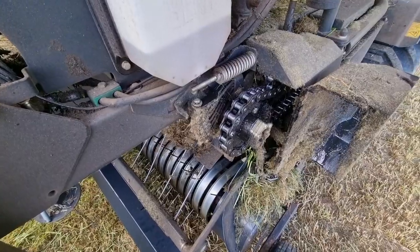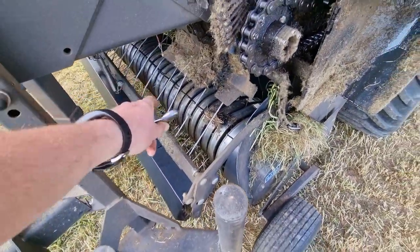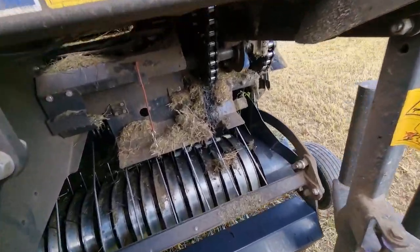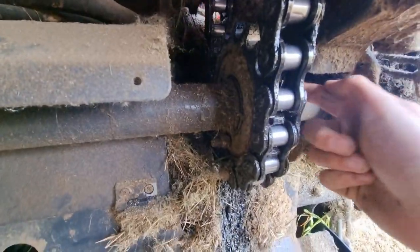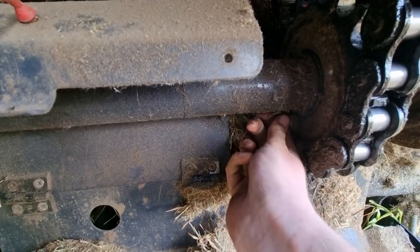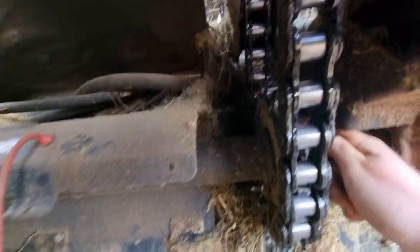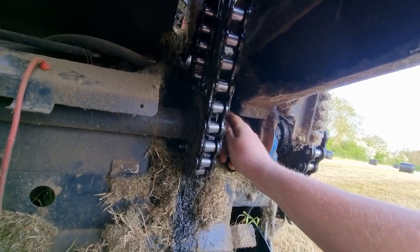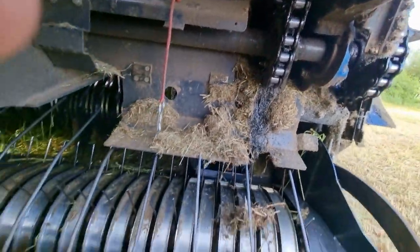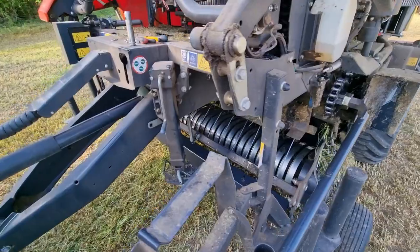So there are two shear bolts in here — here's one but this one's intact, so it's not this one. This one runs the pickup. The other one in here is the one that's broken. Basically there are two cogs that sit next to each other and the shear bolt runs on that shaft — there's the shear bolt. I might have to get a hammer to tap it out. The other side of the shear bolt is up here somewhere, so obviously it's snapped. I need to get those two holes to line back up to push the shear bolt through, which is easier said than done. The farmer I'm baling for is coming to give me a hand because I can't get the shear bolt out.